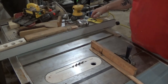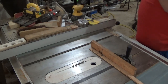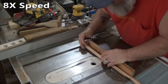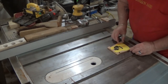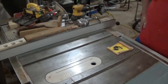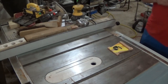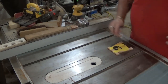I'm gonna start by milling up some stock to make the sides. It's gonna be bigger and bulkier than a normal guitar scale-wise, but I'm just trying to make it hollow, not an actual guitar. The idea here is to make high-angled scarf-type cuts so the glue holds better. The veneers I cut are about an eighth of an inch thick, and the steeper the angle of the cut, the less likely you're gonna have end grain showing up. That's the goal here — let's see if I'm successful.